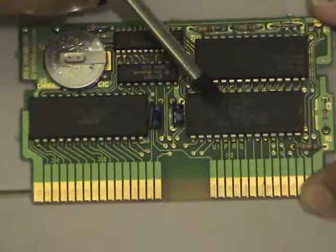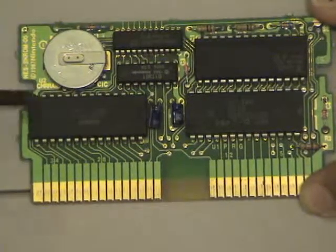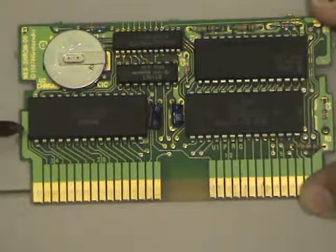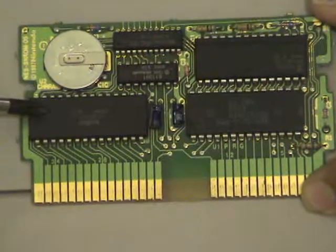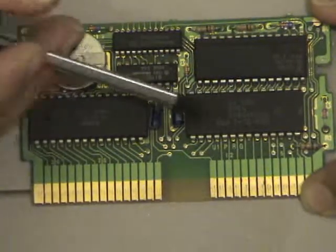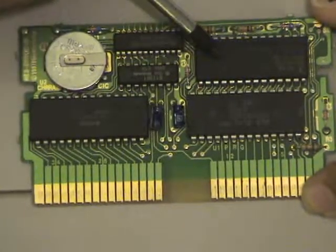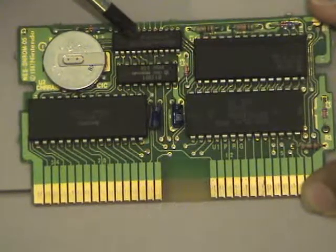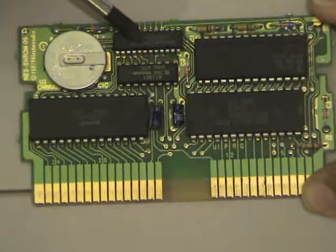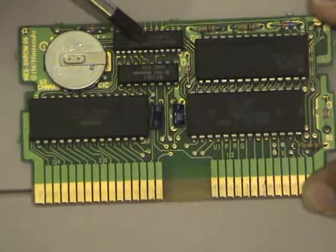Here's our actual program memory. Here's our character memory. We know that they're programming characters because they're actually printed on the circuit board. Right here it says CH-ROM, which is character ROM, meaning this is our graphics, and PRG is our program ROM. And this right here is our actual SRAM. Over here, on the chip itself, we actually see MMC, which is Memory Map Controller, which is just a chunk of logic that addresses what goes where inside of a game.